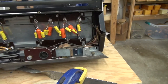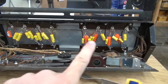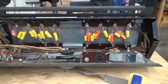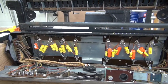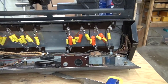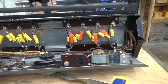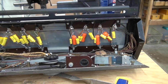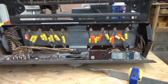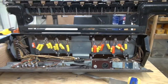When you're playing that top note B, all of the capacitors are in series in a tuned circuit. Remember that when you put capacitors in series, the capacitance goes down. So that's all 12, then 11, 10, 9, 8, and so on, until you get down to one. At that point you only have one capacitor playing, which has the greatest capacitance and therefore produces the lowest note.